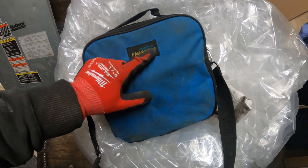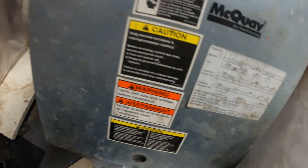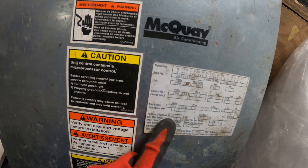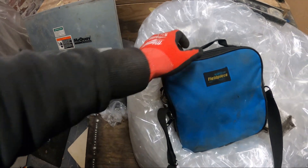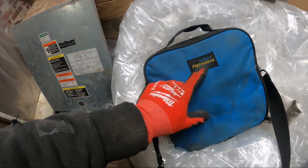The vacuum held and I used a refrigerant scale and charged the system with refrigerant. I took a look at the name tag — if you read closely it tells you the type of refrigerant: R22 — and it has 47 ounces. I do have a video on how to charge a system using a scale. You will see a pop-up any moment and I will leave a link in the description.